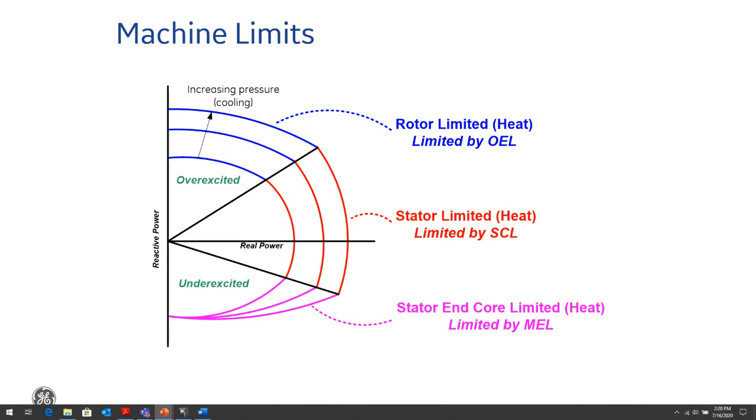situations that can cause us to go into that overexcitation limit of the generator are, again, control failure. We're not able to control the generator properly and it starts to get overexcited. Operational error during offline manual regulation operation. Loss of the sensing voltage to our automatic voltage regulator, so the system is not reading the correct voltage, and it might go to an overexcited condition because it thinks it needs to supply more VARs. System problems such as load rejection or islanding. So when we suddenly lose loading, the machine cannot correct instantaneously, so it goes into an overspeed condition and then